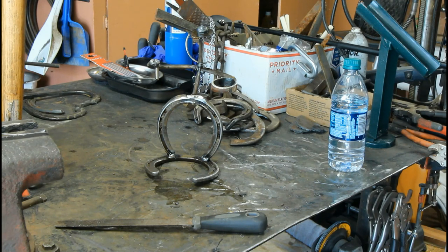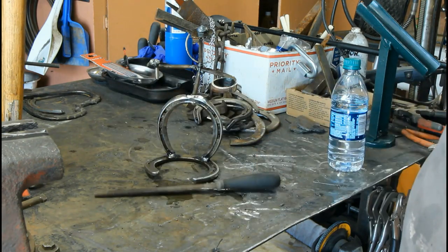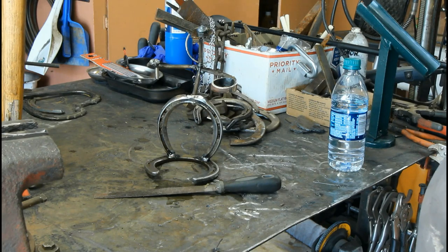What MIG wire did I use? .030. And I used a cutoff wheel, a flap disc, and a Harbor Freight file. We go around, we touch everything up, wipe it down with acetone, and shoot it with Rust-Oleum Ultra 3x Clear. That way they don't get gook and rust and grime on them afterwards. Because it's a shop tool, I won't do anything more than that. I don't know if he will, but you can finish these lots of different ways.